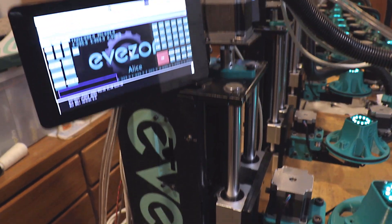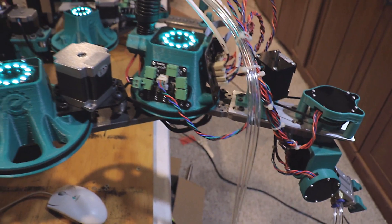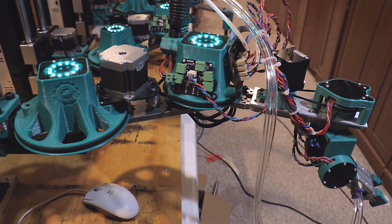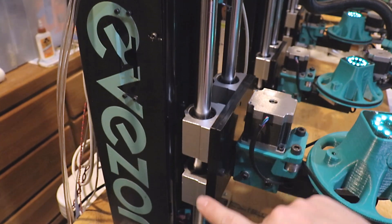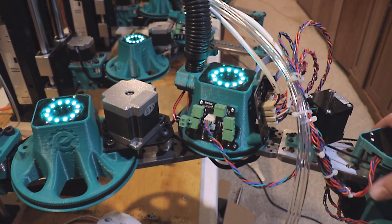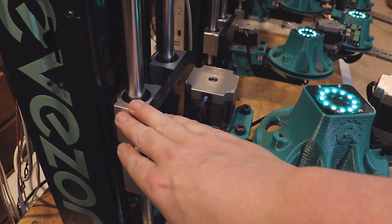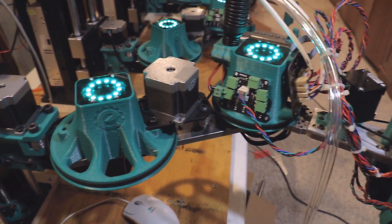As an introduction, we're going to show off this robot. These type of robots are called SCARA class robots — SCARA meaning Selective Compliant Articulated Robot Arm. You can see here that we have a Z rail that moves up and down. We have theta and we have phi, which are the articulated portions. These are called Selective Compliant because Z moves on this axis and these are the two compliant joints.